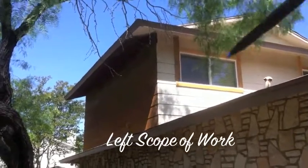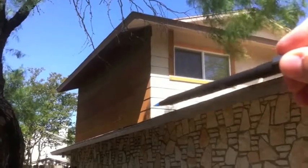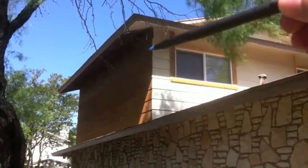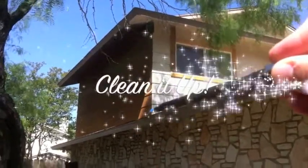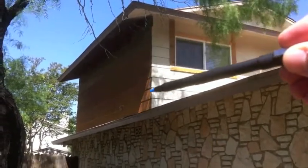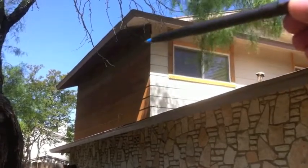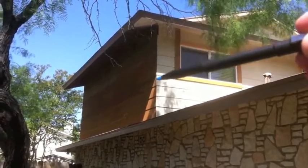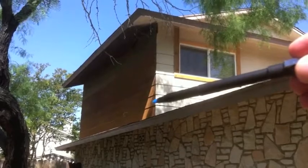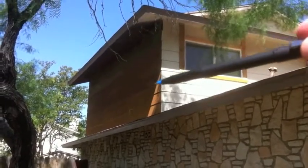Here on the left side of the house we've got a little bit of siding here and this will be matched up with the corners. Right now you've got this staggered lap edge on your siding — we'll clean that up to give you more of a smooth look with clean lines by putting smooth 1x4 corner trim and then butting the edges of the siding into it, so you don't have this kind of prairie-type look.